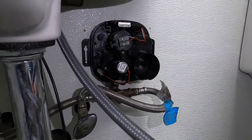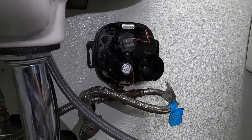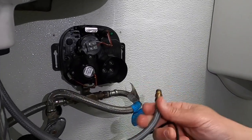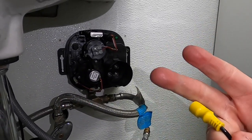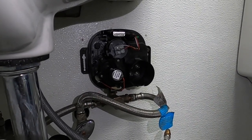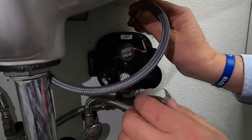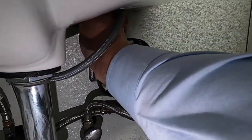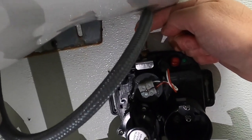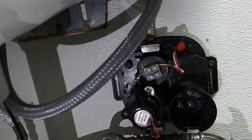After you install your faucet body itself, these two lines will be coming down. One is the single supply up to the faucet, and the other one is to the sensor in the faucet. The easy part about this faucet is you literally just take the line, put it in the back right here, and press the clip. It is now installed.